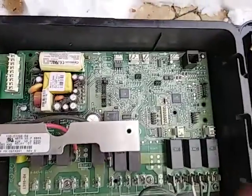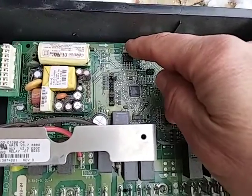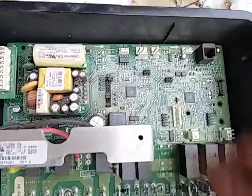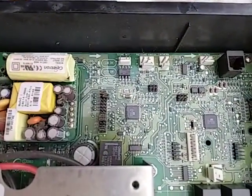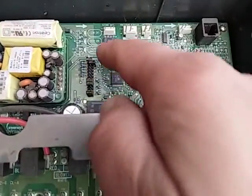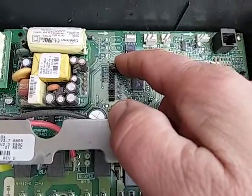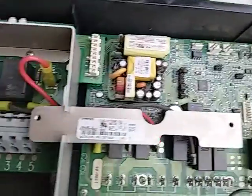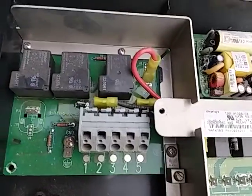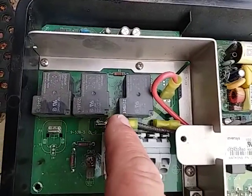On the relay board, you're going to have indicator LEDs. 'Lim OK' is a green LED that should always be on. 'Heater On' is a red LED that should be on when you have a call for heat. Then there's a 'Control Unplugged' LED that should never be lit. If you've got a control unplugged LED lit on your circuit board, call a service tech, because that could be anything from a bad board to a bad control panel.